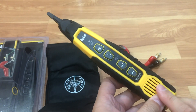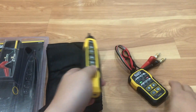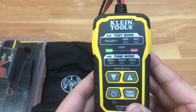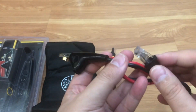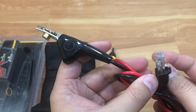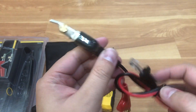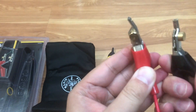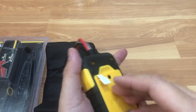This is the receiving device for the toner. You would use this to probe the wires and you would hear the tone from this device. This is the actual toner — you've got three different tone modes, and you pretty much just clamp these onto the other end of the wire or plug in the jack. It will send a tone to that specific wire, and then you use the other device to listen to the tone and know which wire corresponds to the other end, so you can run it in the patch panel.